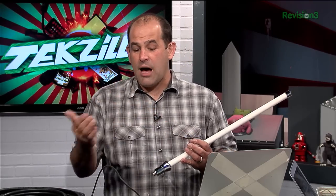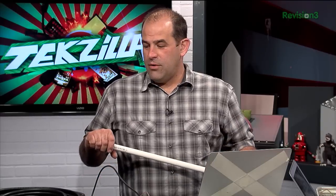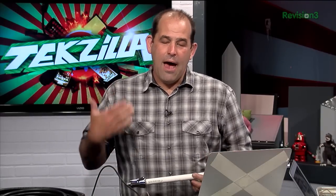Does that mean the FCC is going to come after you for all this Wi-Fi output? The FCC basically says you are not allowed to mix and match antennas and cards — they should be pre-assembled and pre-approved so the card-antenna combination stays under the FCC energy cap. It's always good to follow federal law; they have bigger lawyers than you do. But realistically, unless you do something really stupid like create a 10,000-watt Wi-Fi station in the middle of a large city, they're probably not going to notice. It's another reason to work with Radiolabs — they've been thinking about not getting crushed by the FCC for a long time.